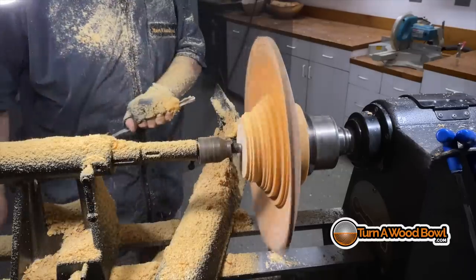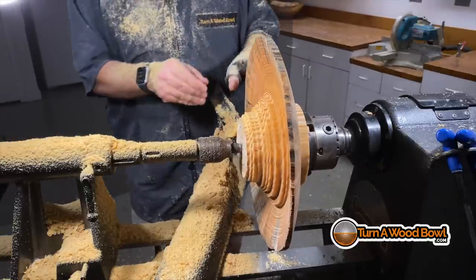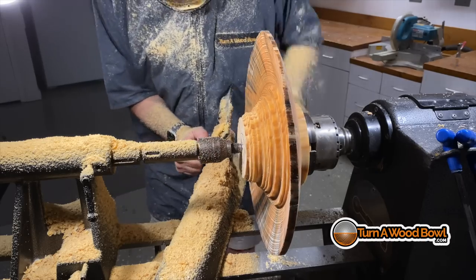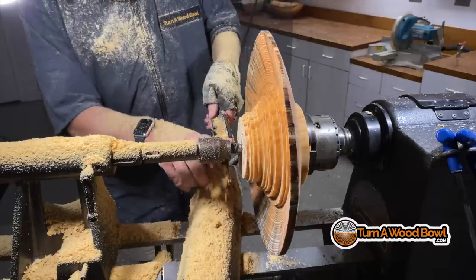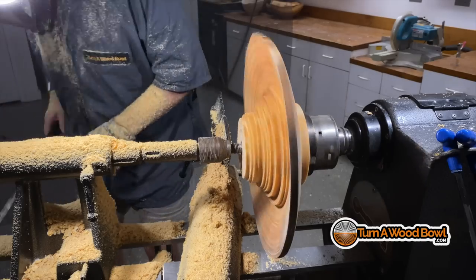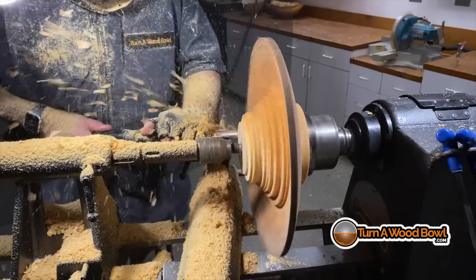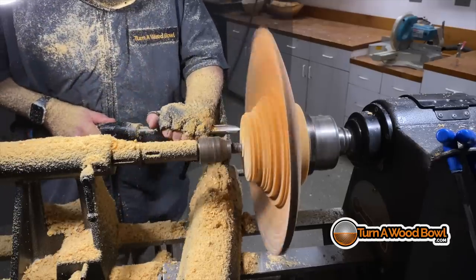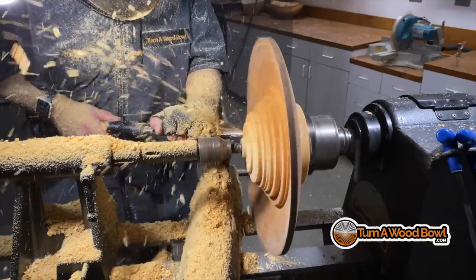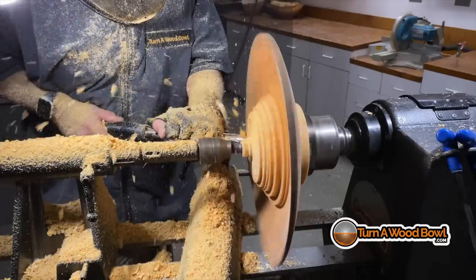However, because this bowl is almost flat, we're really just cutting those top end grain fibers, and they're actually supported with plenty of support behind them. So at a slight angle like this bowl has, I'm okay making a cut going from the rim down to the bottom on an end grain piece. If this bowl had any deeper walls, then I wouldn't be able to do this. I would be tearing out material, and I would have really bad end grain tear out on the sides of the bowl on the inside. But in this case, since it's almost horizontal and we're pretty much cutting across those end grain fibers, we're not seeing much tear out.